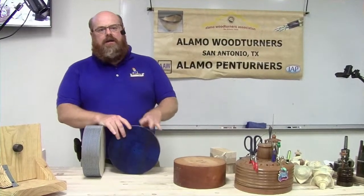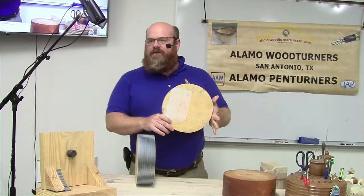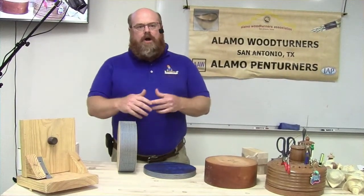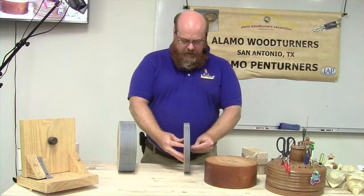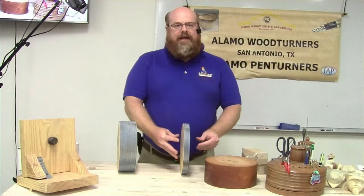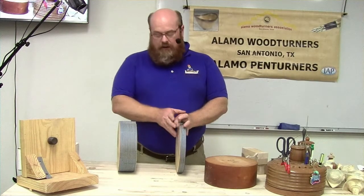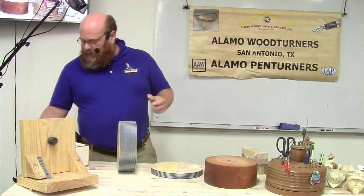Well, the problem is, how do you get that first chuck of a 1-inch piece of wood that's 9.5 inches wide? And that was something I had to try to figure out to do effectively. I could have used a prong drive or whatever, but when you've got a prong drive, the biggest problem is you're holding here. Any deflection at that range, even 5 degrees off from center, is going to shrink up this piece a lot more than I want it to be. And so I had to figure out a way to really get a good base hold.